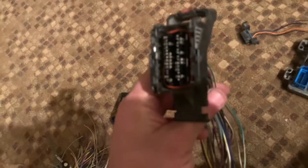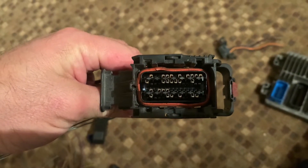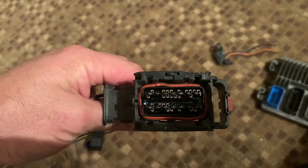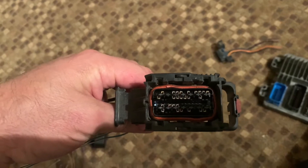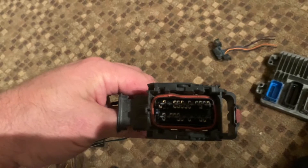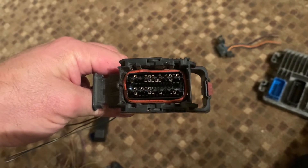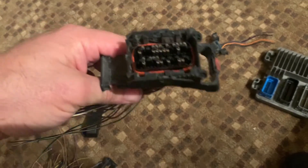When you get in there you'll see the inside of the plug with all those pins sitting in there. I just went ahead and de-pinned everything because you really don't need all those wires hanging out — you're only looking for about five wires. The rest are going to be a hindrance because if they're powered and they touch each other with the stubs of wire you cut off, you could fry your computer.